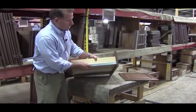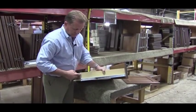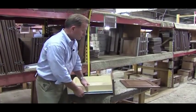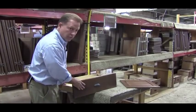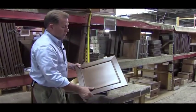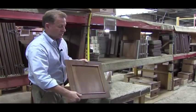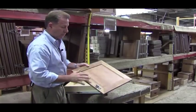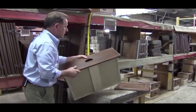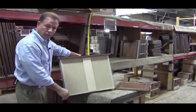If you take our Open Range and residentials, we're using a dovetail drawer box just like a residential home has, with the heavy duty 100 pound ball bearing roller guides. All solid wood drawer fronts and cabinet door fronts. You also see we use all concealed residential hinges, no exposed hinge. It's a residential pocket hinge. Gives you a very clean residential look in our coach. We don't cut corners on that. The other thing you'll see is any drawer this size or bigger is going to have a brace down the middle underneath that you don't normally see.